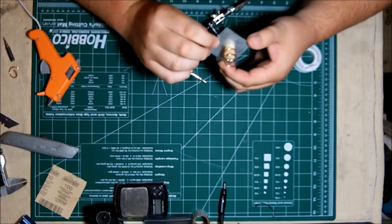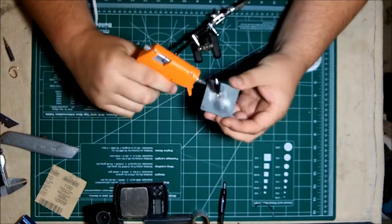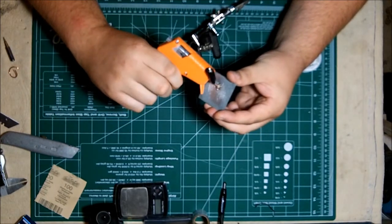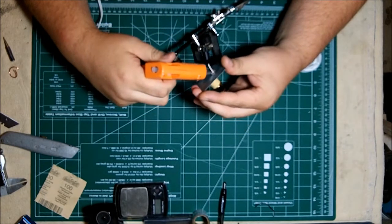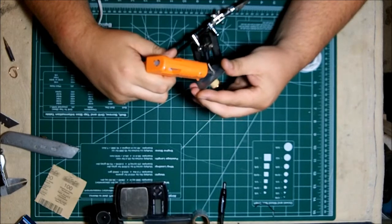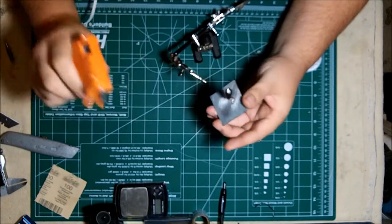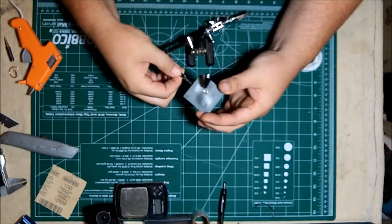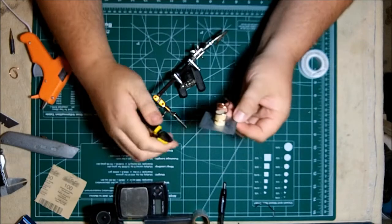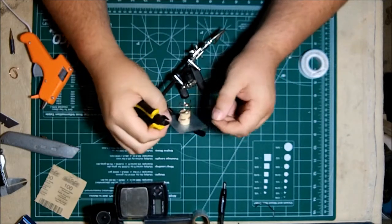Make sure that when you solder the coil onto the center conductor, you actually have a feed gap left and that you're not touching the outside braiding. On the back, I go ahead and usually hot glue just around where that solder joint is for a little added protection. I would hate for wiggling of the wire to actually break it.